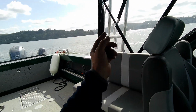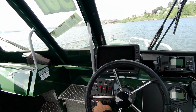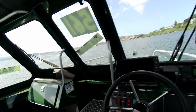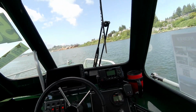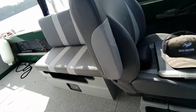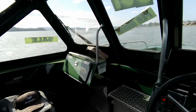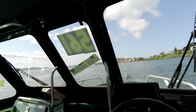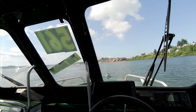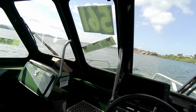Okay, live well. I'm going to hit that switch on right now so when I go to the back, I don't have to worry about it. I'll hit the nav lights. Bilge pump works, and I already checked all that. You've got a front tank here too. Where your sending unit is, it's probably right there, and I'm thinking it's there. But anyway, this has a 90-gallon tank, so you can't check it when it's flat, because if you do, it's going to show empty.